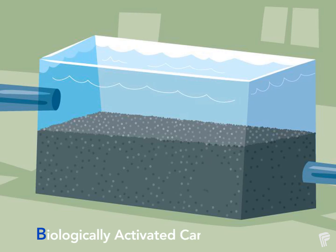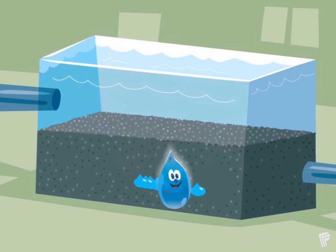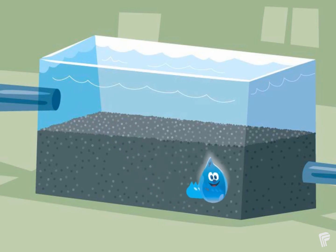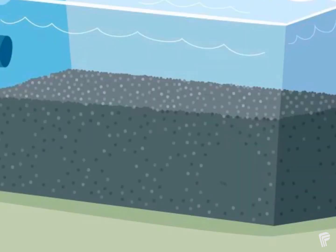Biologically activated carbon contactors are the next step in cleaning the water. This is the B in OBM2. This step is a filter for the water. Here, water flows down through three meters of carbon pieces — that's about twice the height of a grown-up. The carbon pieces kind of look like popcorn. They have tiny holes and gaps in them. As the water flows through the carbon, the germs that were killed get trapped in the holes and gaps. Good germs also live in these spaces and they eat the bad germs that get trapped. This takes away any of the bad taste and stinky smells from the water.